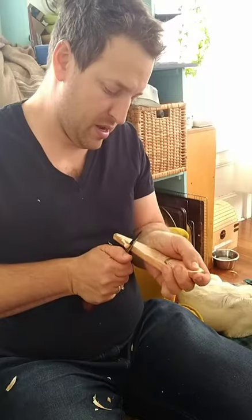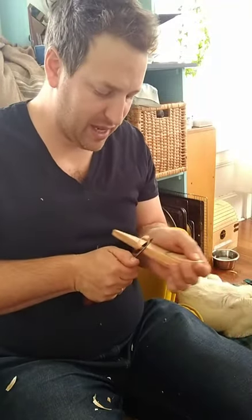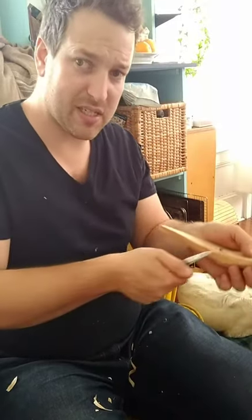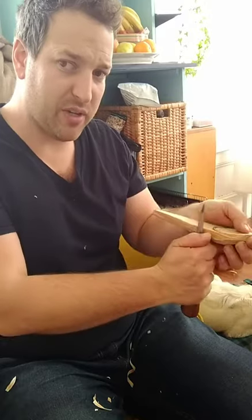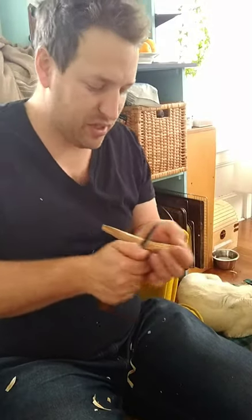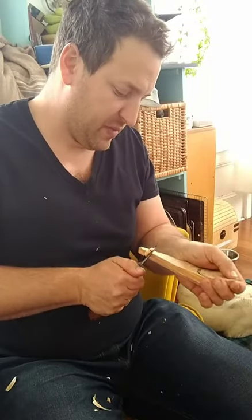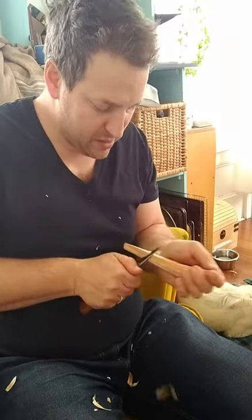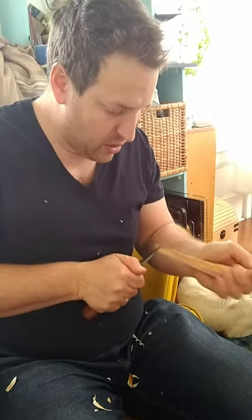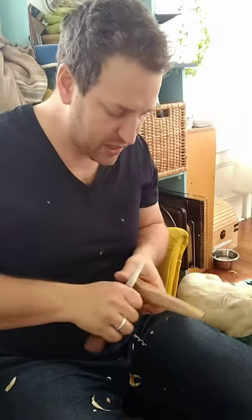And then I'm pulling and it's maybe angled slightly so that there's a natural sort of slide of the blade along the wood, as opposed to being straight up and down, in which case I'm just pushing like a chisel would. But instead, if it's skewed slightly, then I can get a longer, cleaner cut. So, okay, there's one side.